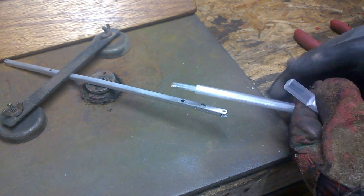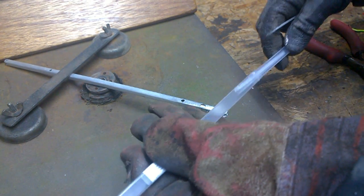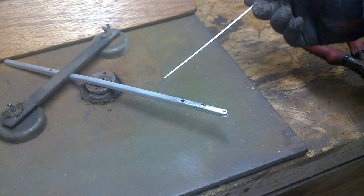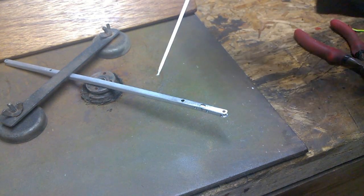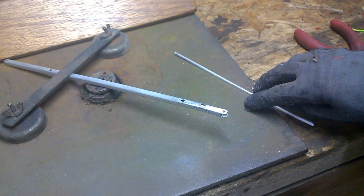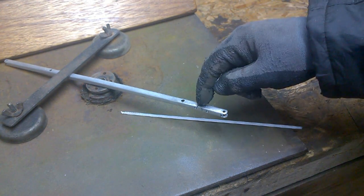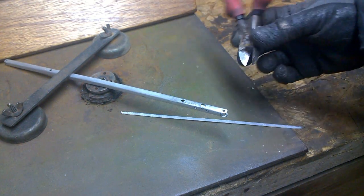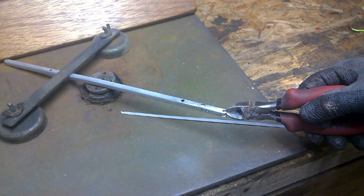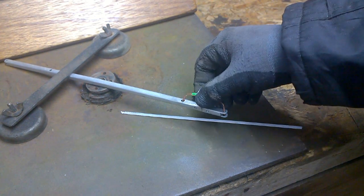Here are our soldering rods — these are extra low temperature aluminum brazing rods, available on our website. The trick with brazing rods is to remember: it is the temperature of the work piece, not the temperature of the blowtorch, that melts the rod. Get the work piece hot enough in order to melt the rod when you touch it. You can only weld this once, because if you try to touch it up later it would melt the existing weld — so this is a one-shot deal. To that effect, have tools handy to hold everything in the correct orientation while the aluminum brazing rod is setting and cooling down. In some cases you could use a bit of wire to hold everything together.